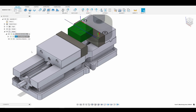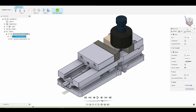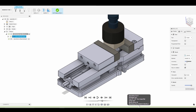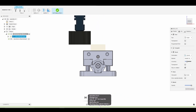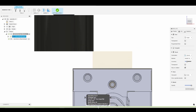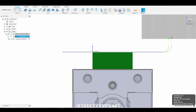Let's go ahead and simulate. I'm just going to drag the timeline to get a nice view. So let's go back to the home view. It's a rather large tool, but there we go. What we'll do is go to the front view and use the timeline. I want to make sure I come all the way off the part. I don't like what I see — we are barely coming off the part before we retract.